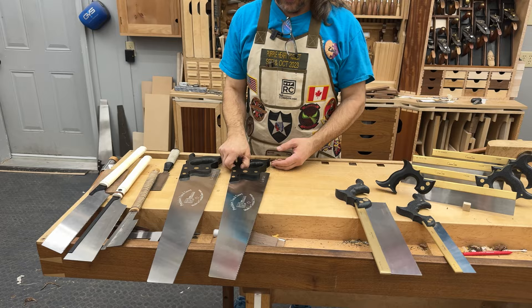Panel saws are primarily used for breaking down your lumber. You buy a piece of wood that comes right from the mill — it's rough, random length, random width. You want to take it down with a saw before you take a plane to it; you can saw a lot faster than you can plane. These are the types of tools to get your stock down to approximate size. That brings us to crosscut teeth versus rip teeth — there are times when you'll be cutting parallel to the grain, and times when you'll be going across the grain.